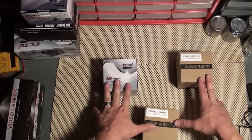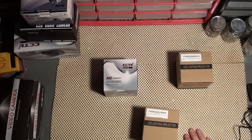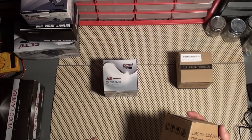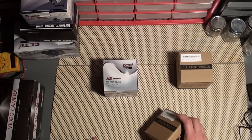We have three IR illuminators here, and just like our other video, these are the very affordable ones on Amazon — we're testing the lowest cost IR illuminators. All three of these are 850 nanometer wavelengths. Cameras pick up wavelengths of infrared light and there are different wavelengths — the more sensitive the camera, the higher nanometer wavelengths it can pick up. You can see normally anywhere from 730 nanometers to 940 nanometers. The 730 nanometers would be the normal red glow you see from a security camera. The 850 nanometers greatly reduces that visible red, which is ideal for having them mounted outside. It also takes a better sensor to pick those up.